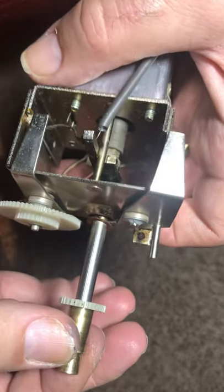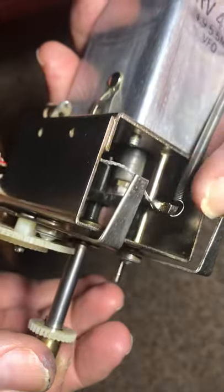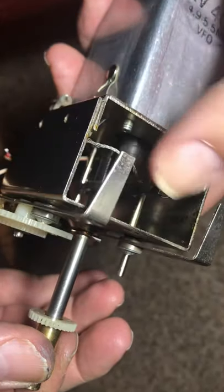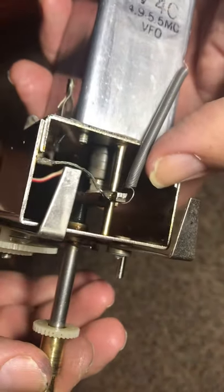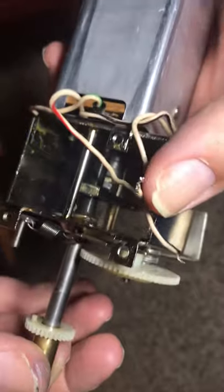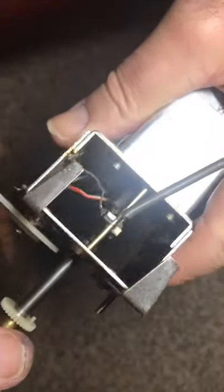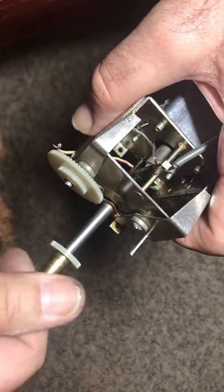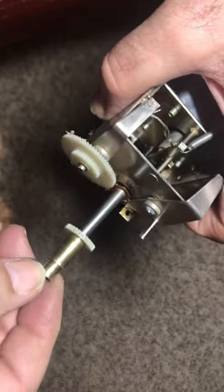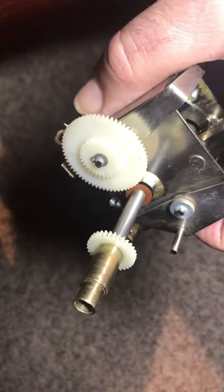It's now time to put this thing back together. Drake says to solder some lead to this center pin on these C-type PTOs — VFOs, I'm not sure why they call it a VFO when it's a PTO, but that's that. It's very unpleasant to unsolder these wires but I did it again, and I guess I'm going to put it back in and see how it goes. See if it'll retain its ease of motion. You want to keep this thing non-lubricated — put your oil can away, as they say.